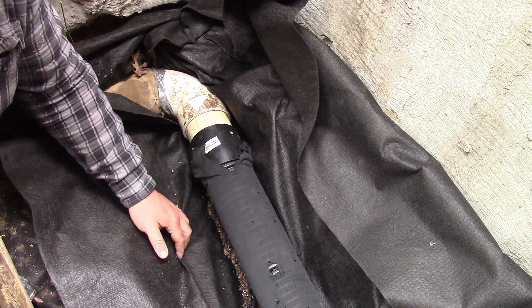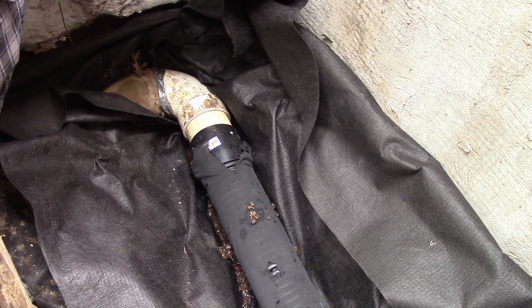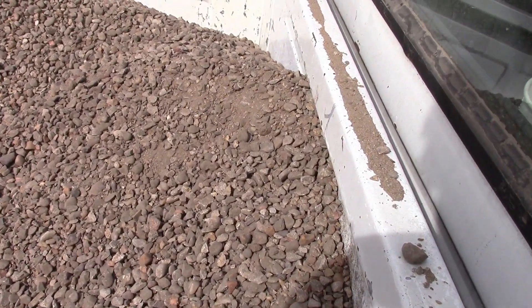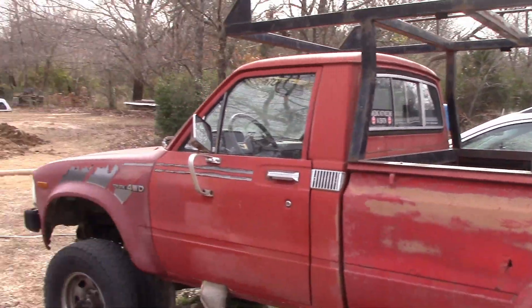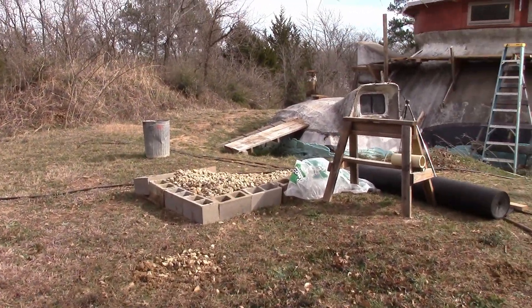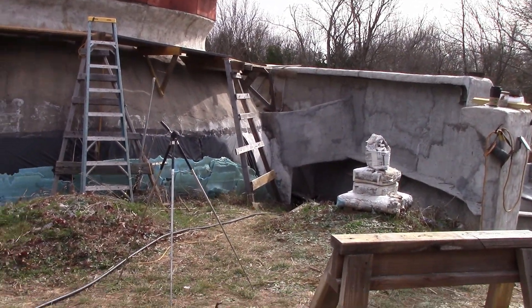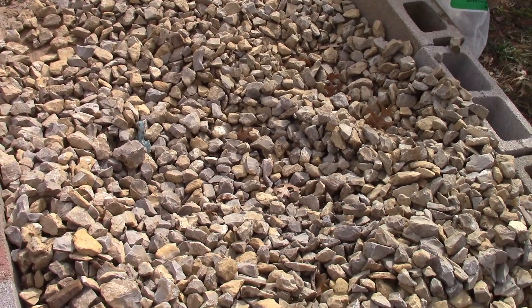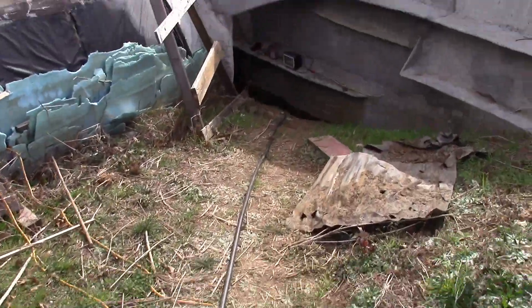I'm kind of thinking about this sock since I'm using pea gravel. The pea gravel has some pretty small rocks in it — it'll keep some of the little rocks from getting right into the grooves, but I don't think there's any way I can clog them all up. I have two kinds of rocks I'm using: there's this pea gravel — it's pretty contaminated so I've been screening it — and then there's the bigger French drain rock, sewer leach-field rock, that we originally used. I pulled out a bunch from down there in the catacombs. The bigger the void space in the rock, the faster the water can flow in theory, and maybe the longer it flows fast before it gets contaminated.